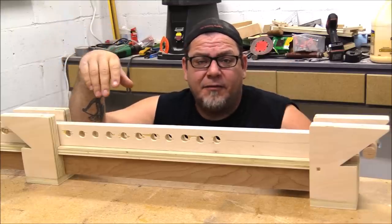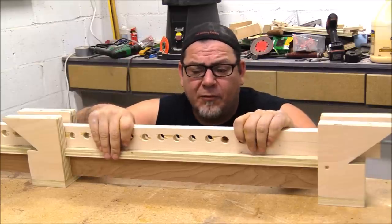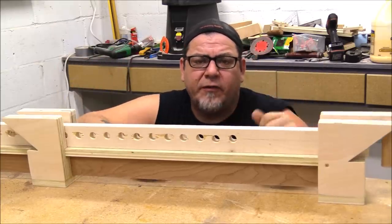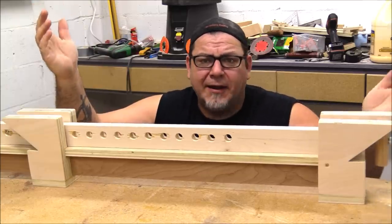So that's it — we have the track, blocks, and top rail. I need to cut some dowels for the back side, and then I want to treat these with some paste wax. You could use packing tape as well. Any parts that are going to be exposed to the glue-up you'll want to treat, otherwise you'll have wood going to wood. So voila — see how they work.